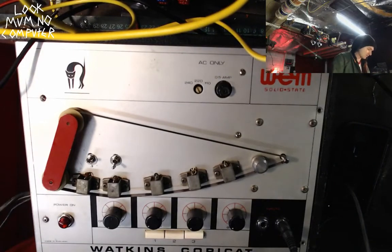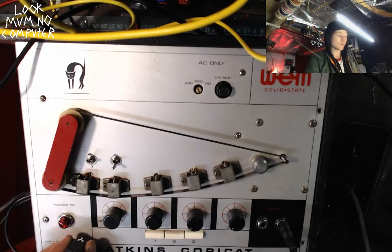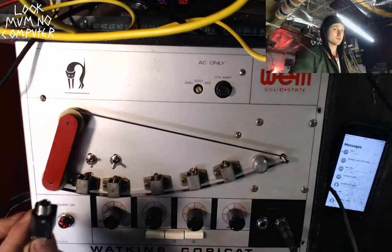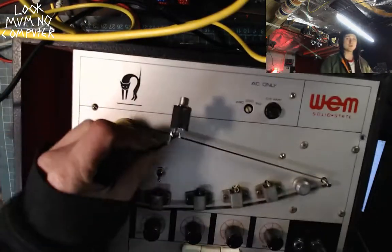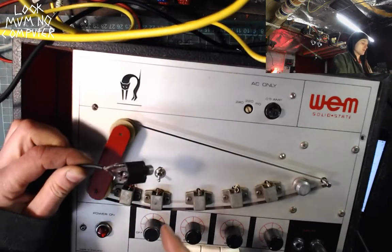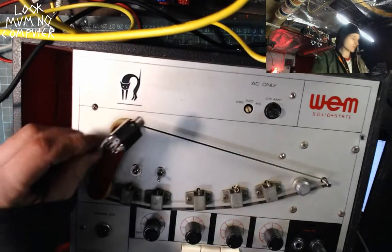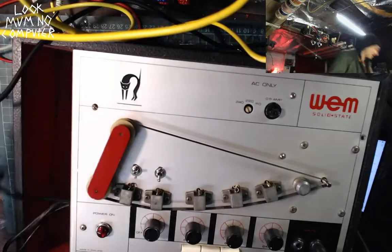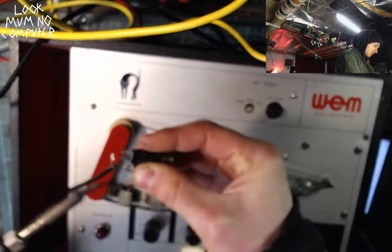So I'm going to have the wet output and then the dry output. But I think I might put a knob on there and see if I can have it blend in between. But we'll see. If you've got one of these, it's quite easy to get the wet output, because these sometimes come with pedals that turn on and off the wet output from the signal. What you do is you remove the pedal from it, because what the pedal does is it just sends the wet signal straight to ground, grounds it off. It doesn't come out. So you could just hardwire it to wet out. But anyway, I need to remove this jack socket again, because I'm not going to get it through the actual. Come on.